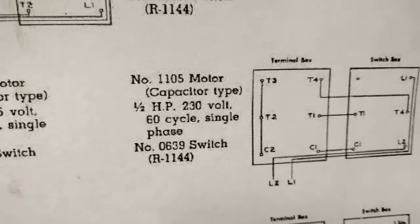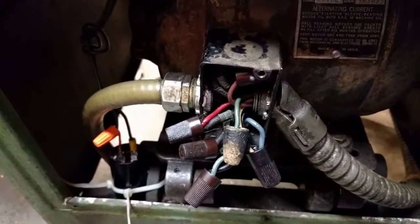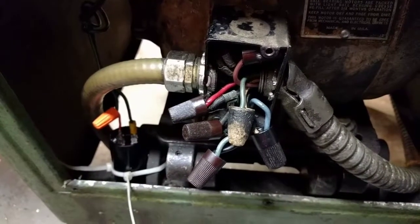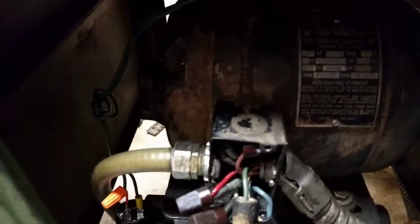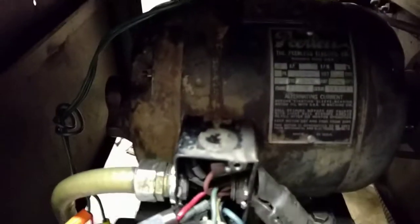I did it backwards — oh great. There's also three phase. As you can see from the junction box on the motor, it's a very tight fit, especially when you have all these wire nuts that somebody had originally wired it with. So right now I just moved the capacitor down and off the motor, so if it ever pops again it's not going to leak oil all over that. I'll probably need to attach the wires to the top of the motor just to be safe so there's not a lot of movement, but for now this will work.